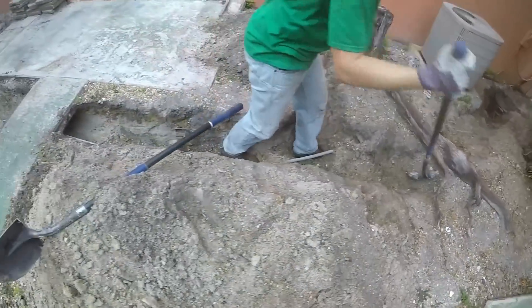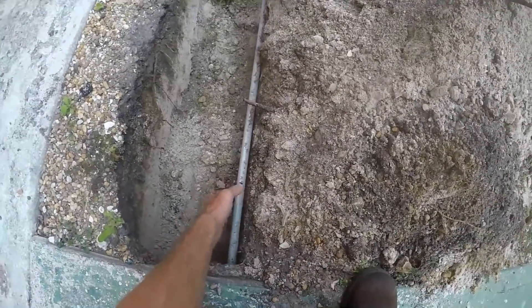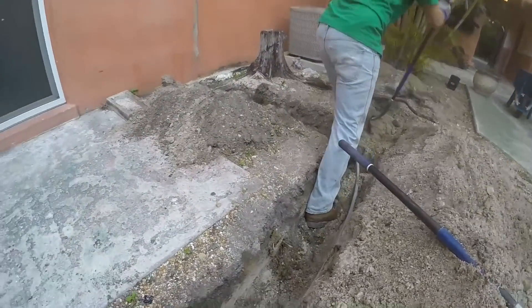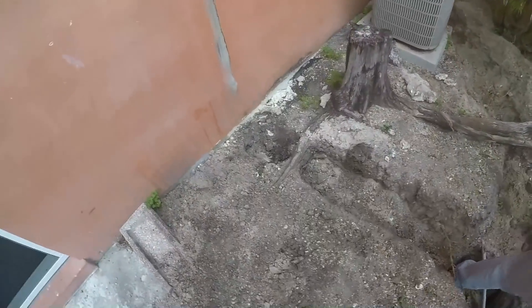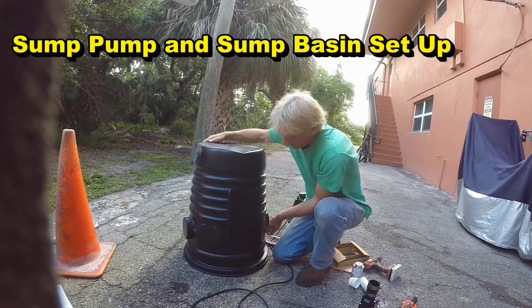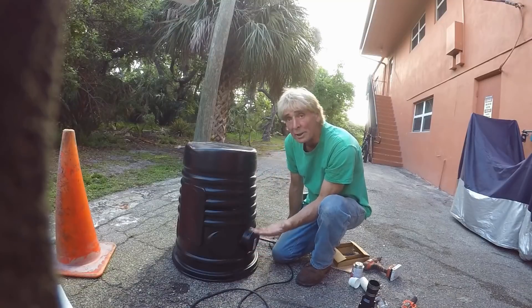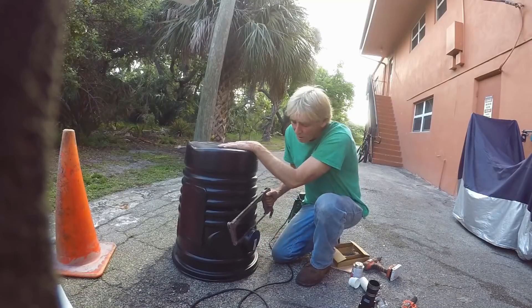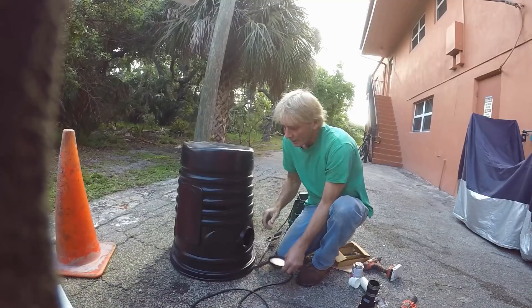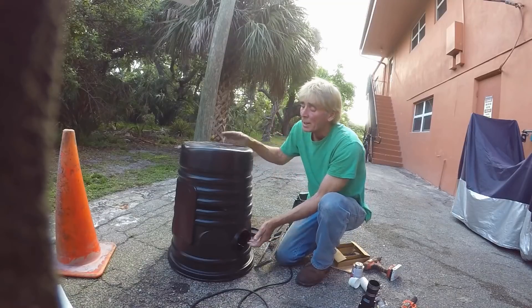Whatever you've got to do, you've got to do. If you find an electric line in a conduit, that's great because you can lift it up and move it around — not a problem. We can put our pipe right underneath. There's a T right there and a downspout drain coming across as well, but it shouldn't be a problem. Now it's time to set up our sump basin. The sump basin comes with two nipples and they're usually at the right depth. If not, you can drill a four-inch hole to accept your inlet line. Using a good sharp hacksaw, cut that right off — this is where all the water we've collected comes in, so we call this the inlet line.